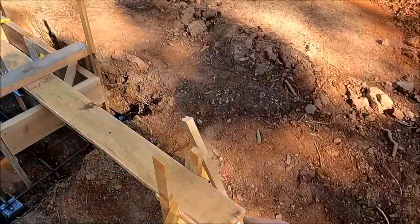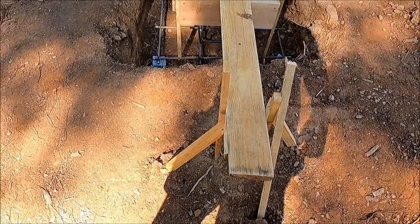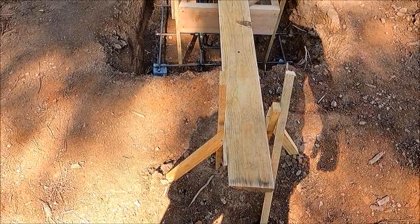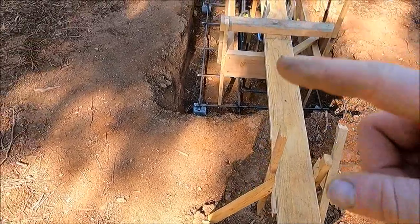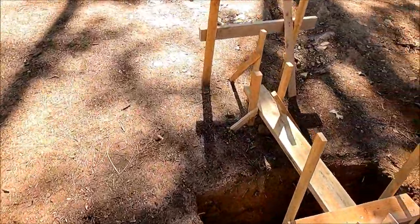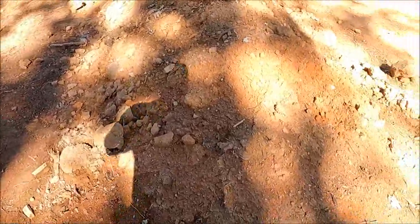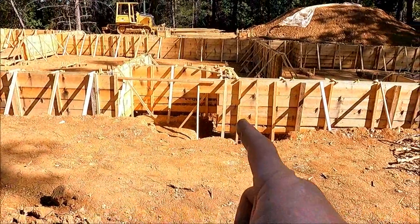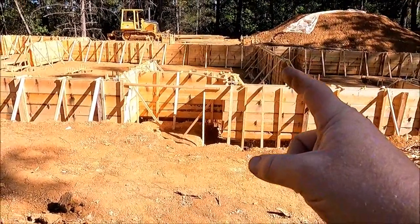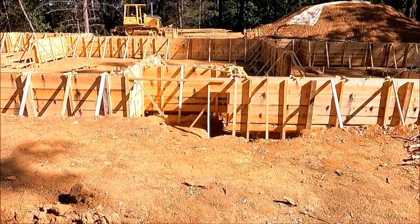I would have run it straight, but my ditch witch would be digging up all the nice supports that Gary, Mike, and Mark put in. So I'll just 45, and the nice thing is it'll be out here in the dirt rather than buried under concrete. And then I will trench from the pier here over to the entry so I can catch a light switch just inside the entry to turn these on.